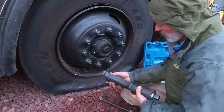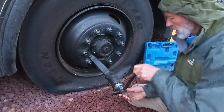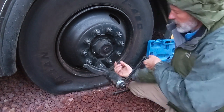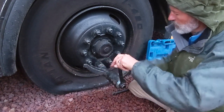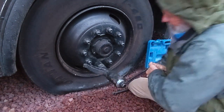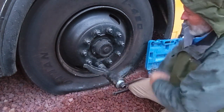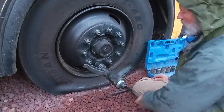But with this, putting the foot up against something, like another nut, and I want to be on that side. So I'm rotating this, and it's turning the nut that way, same direction as the handle, and this foot here is braced against this lug nut there. So by turning this now, that's still tight. Somebody over-tightened these, but I can break that loose. And it is turning, so I'm turning the handle, and this lug nut here is turning. So I just loosen that up, go around, loosen these all a little bit.